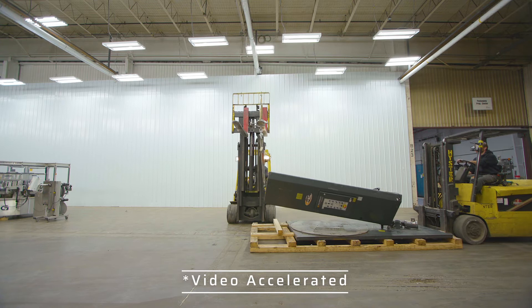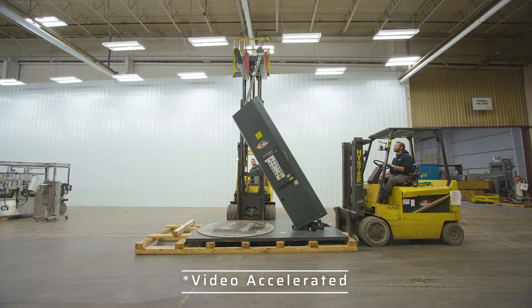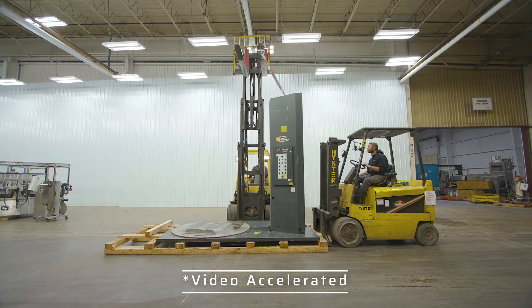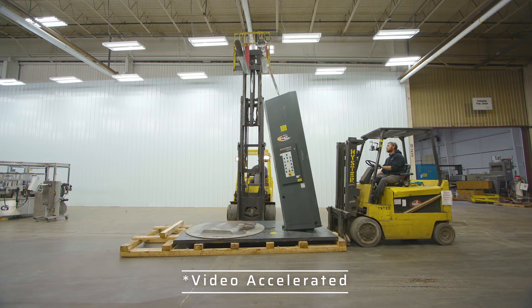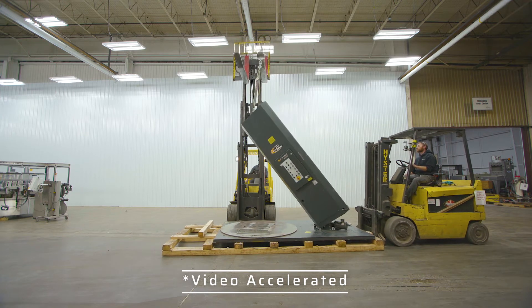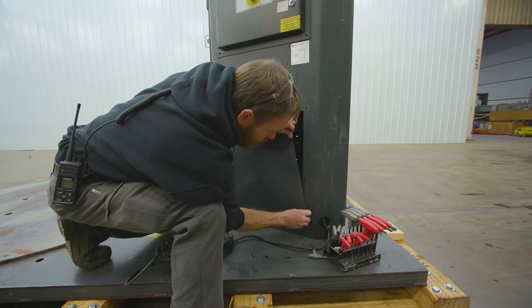When you're raising up and laying down this Wulftec you really need two forklift operators that are in sync — that means communication is key. You need to be moving in motion together. If one is raising too fast and the other is not pushing, you're liable to damage the machine or break the strap.